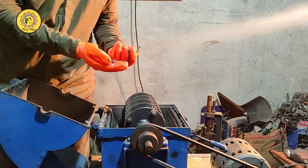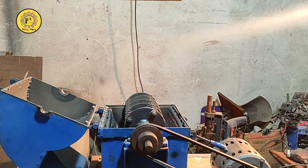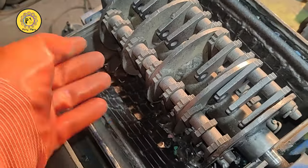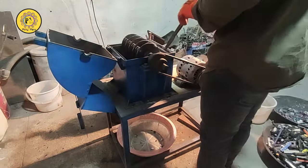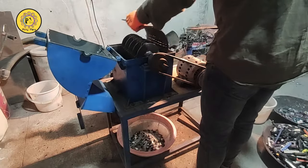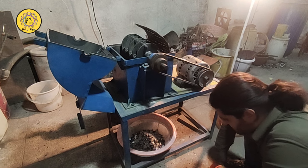I opened up the hammer mill to see what's going on inside and I saw something interesting. The pins had fallen out of the tray and the steel parts remain in the tray. That's a good result. But there is an issue: after accumulating enough steel inside the hammer mill, it's going to get jammed, and to prevent that I need to evacuate it from time to time. This way I can separate good materials from the bad materials. Good materials would be sorted into the bucket, and bad materials, which are mostly the steel cover, would be in the other dish.